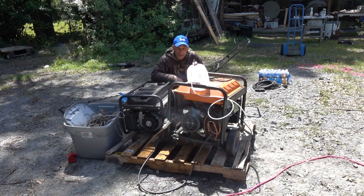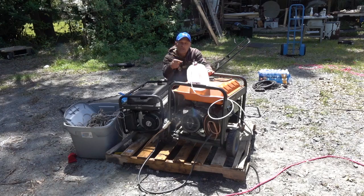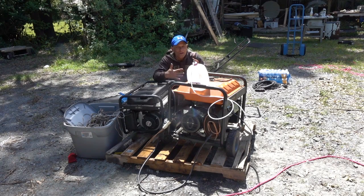You can use the same heat exchanger we're going to be using for solar to get the heat from the exhaust system — the muffler — that just goes out into open space. Of course, you don't want to put one of these inside your house or garage, because they will kill you with carbon monoxide. You do not want to try to be creative and come up with a way to heat air in your house if it's cold after a big storm, because a little leak could be deadly — just don't do it.